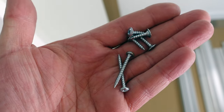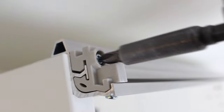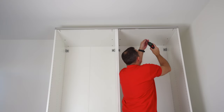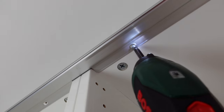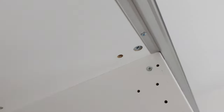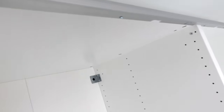The holes are good and the edge is lining up nicely. We're going to need two long screws with the round head — secure the rail on one side, with the screw going through the rail to the side panel. Exactly the same on the other side — screw through the rail, through the plastic in the rail, all the way to the side panel. Now we're going to need four small screws coming from under the rail to the top panel. Two small screws securing the rail from under on each side. We have the top rail done.